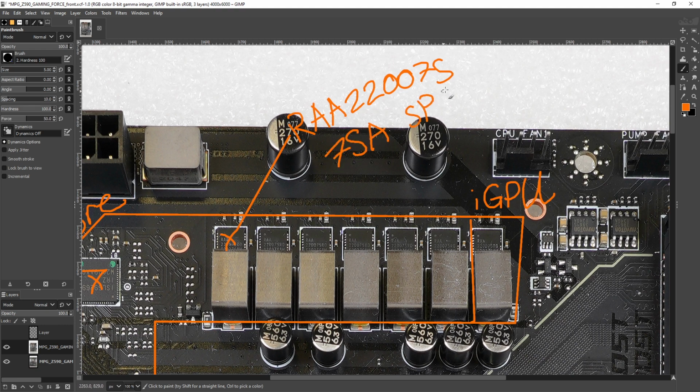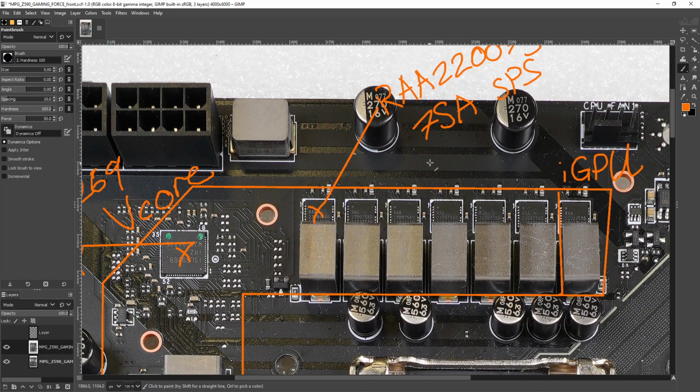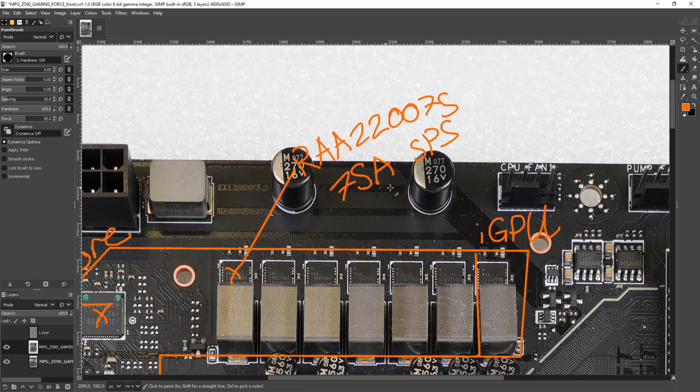These are called smart power stages because they integrate current monitoring and temperature monitoring and a bunch of safety features like short circuit protection, over temperature protection and over current protection, and all kinds of fun stuff like that. And you can get components that don't integrate all of that, which just makes designing the motherboard more difficult. But on the flip side, the components are cheaper.